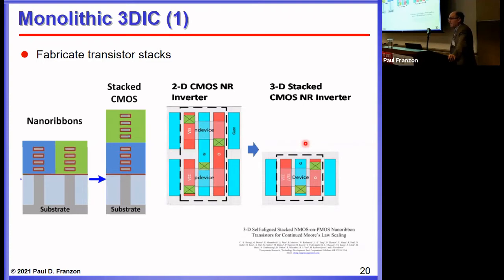This could be a dramatic impact. As we've gone from 15 to 10 to 7 to 3 nanometer, we haven't seen a big increase in density of parts, because transistors don't scale smaller as fast as expected and the size of an AND gate doesn't scale with the process node. But with stacked CMOS, you get a direct 2-to-1 scaling increase, which could be very significant. That's possibly around the corner in the conventional semiconductor roadmap.